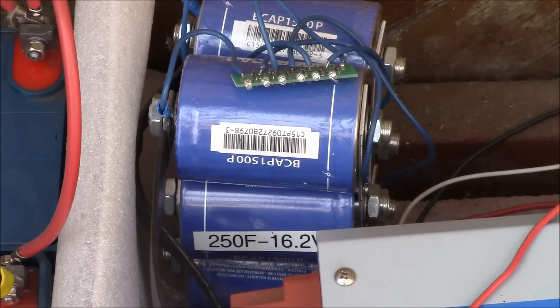While a supercapacitor can store a lot of energy — at least for a capacitor — it's not going to run a power inverter for very long. I charged it up and connected a 5.5-watt MR16 LED bulb to it and it ran for about an hour before hitting 6 volts. That bulb draws constant power down to 6 volts, so that would represent 5.5 watt-hours of energy down to that 6-volt reading.